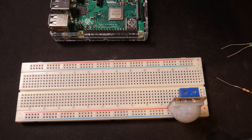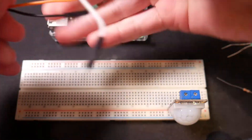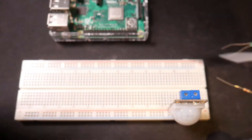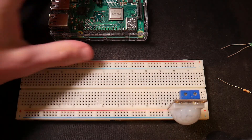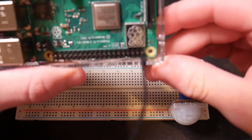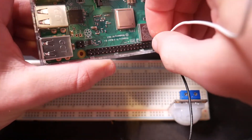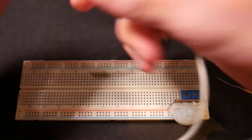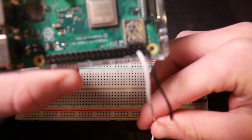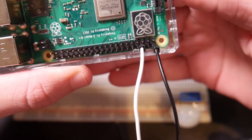Now what I'm going to do is plug in some jumper wires. There's a link in the description if you don't already have some — they're really cheap, just a few bucks on Amazon. We're going to need ones that have female on one end and male on the other. I'm going to plug in three of these to start into my Raspberry Pi. We're going to start by plugging one into the five volt pin, which is the pin on the very bottom right. Then we skip one pin and plug in this white wire to the ground pin.